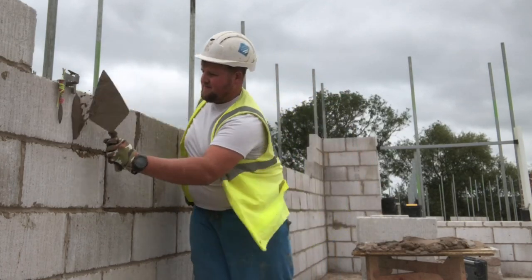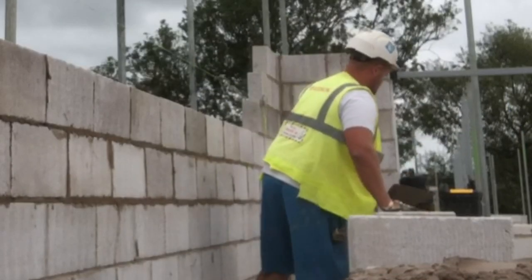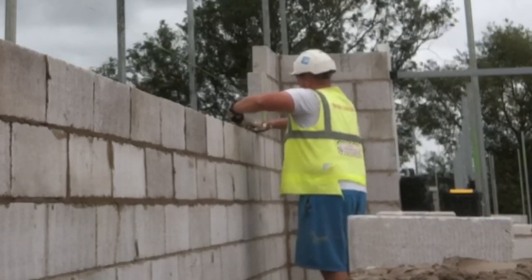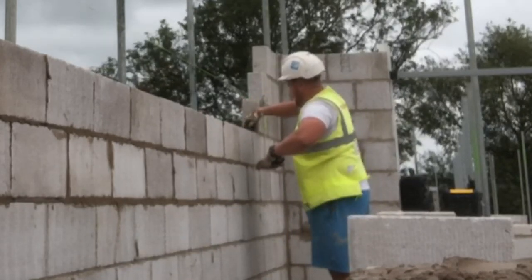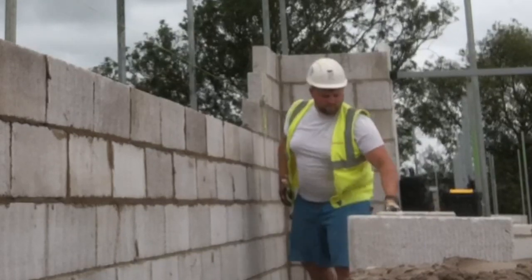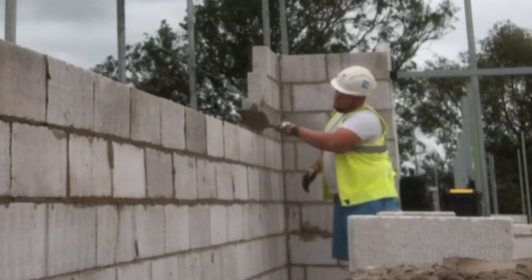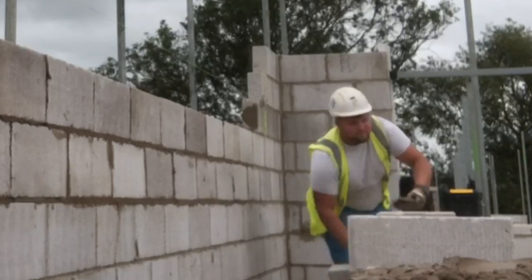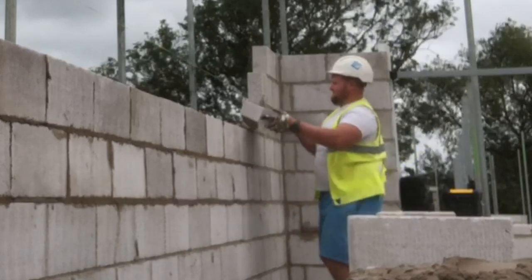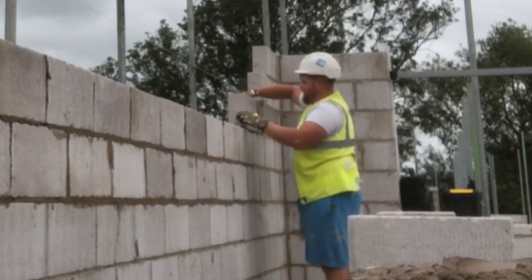Square boxes. The only downside is there's step trays on front and back, but I'll make sure I work them. I'll post a picture in the next video and go into detail about step trays. Some guys use block work behind the step trays to get them up a bit quicker, but I'm counting all these lifts on measure. I'm not taking a plot price because I've taken over them. I'm just counting measure what we've had to do. It makes more sense laying bricks under your step trays than blocks. You get paid more for 4 bricks than you do for 1 block. So that's something to think about.